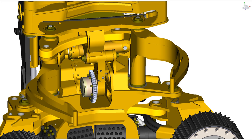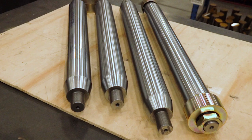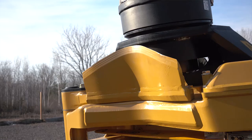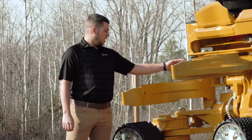The knife arms and wheel arms both utilize timing links. These links are a lot thicker and more robust than our competition's. Larger pins withstand the occasional overload, preventing broken links, which is a common issue on competitive heads. The floating front knife is a swing arm design with large pins, replaceable bushings, and a spring preload. This provides more positive and controlled action and a longer service life than sliding front knives.